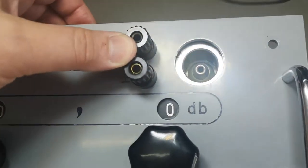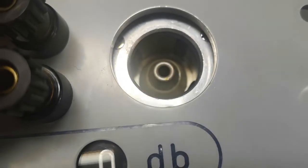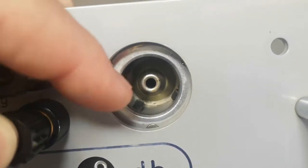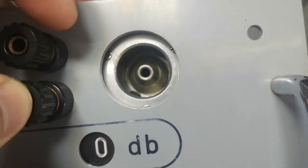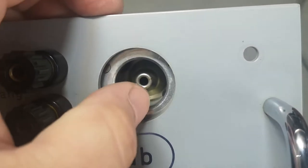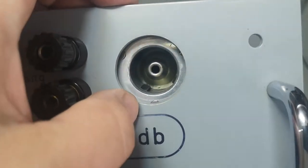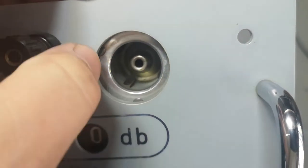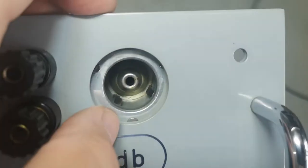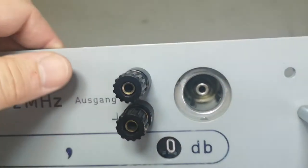I'm not exactly sure about the connectors here, but looking carefully it seems there's some ceramic isolation down there and the center is actually banana plug compatible. You can imagine a connector that's like a banana plug with a metal ring that touches the spring — we've got four spring-loaded contacts. That is how you get the two megahertz bandwidth.